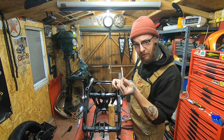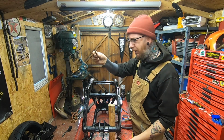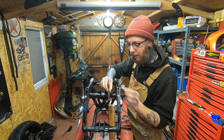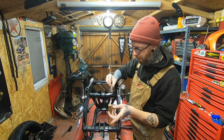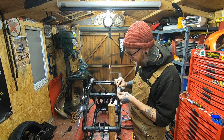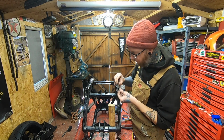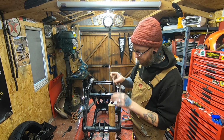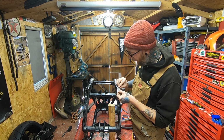And again, true Blue Peter fashion, here's another one I made earlier. Using a little bit of adhesive spray, I sprayed it on, stuck it onto the piece of metal, and cut round it. I've then spent a little bit of time fettling it, grinding it, so that I know this fits perfectly into the hole. I've then chamfered the edges of it, cleaned it all up, deburred it, so once it goes in, I can get a nice good weld all the way round it.